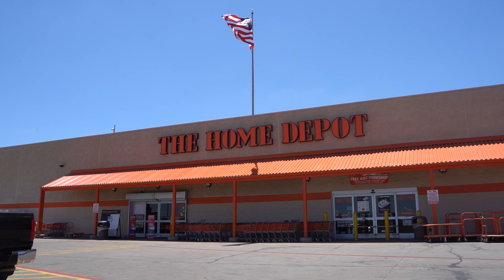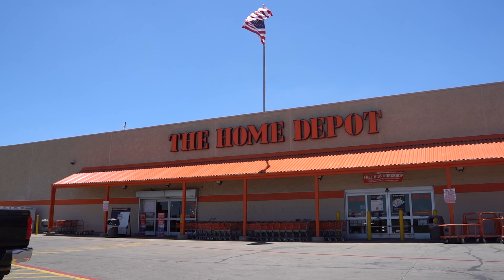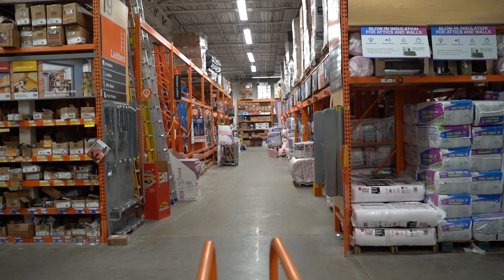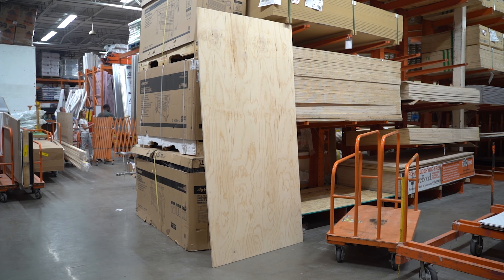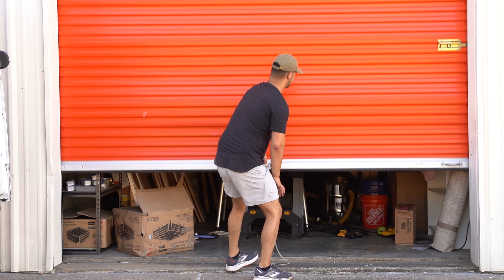We're just going to roll our Home Depot b-roll because that's where we always start. As a fair warning, you're gonna be grabbing some four foot by eight foot plywood sheets which will probably require you to rent a U-Haul or a pickup truck. Make sure you find the smoothest three quarter inch sheets possible, as the smoother they are the easier it'll be to get that picture perfect paint finish. Be sure to check if there's any bend in the panels — you'll want to find the most perfectly flat panels possible, that's so important here.